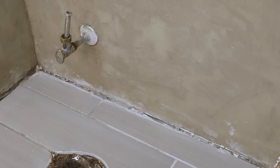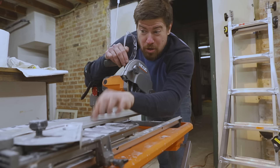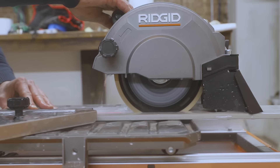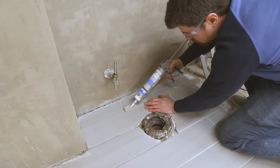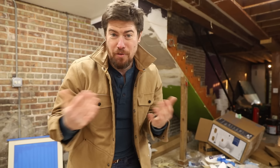Now we've got to deal with the floor to wall transition because it's just not very clean. What I'm going to do is cut two inch strips of the same tile I used on the floor and make some trim out of the tile. If I were to do this again I'd probably just apply the trim at the same time as the floor tile and use grout instead of silicone, as I think this would have a more consistent look and we really don't need the silicone's waterproofing in this bathroom.